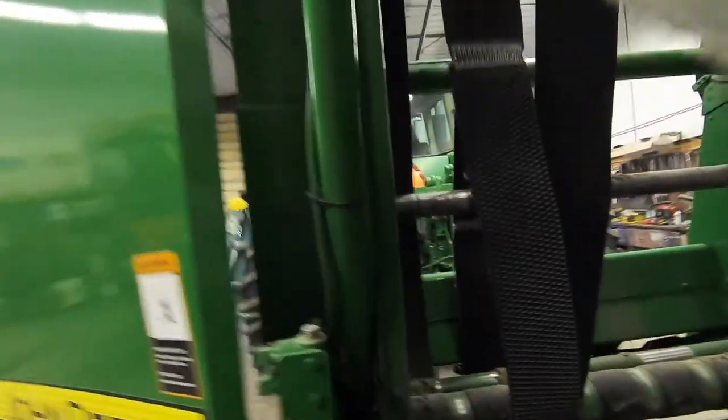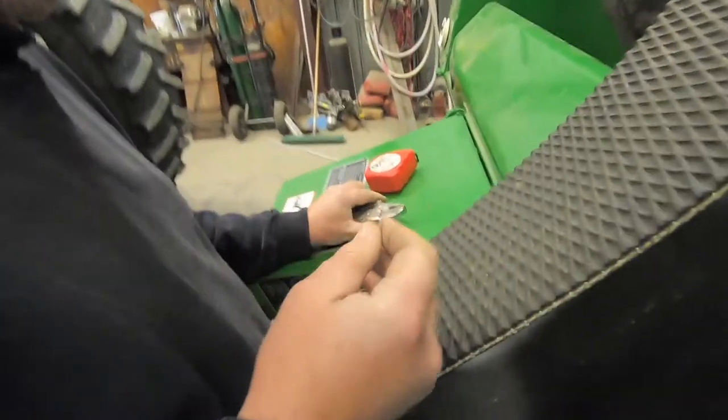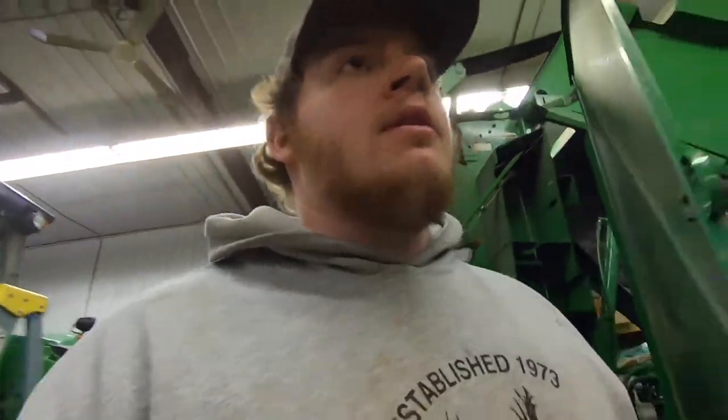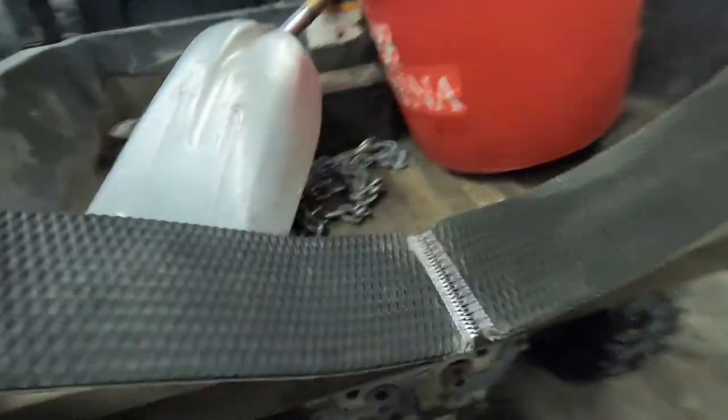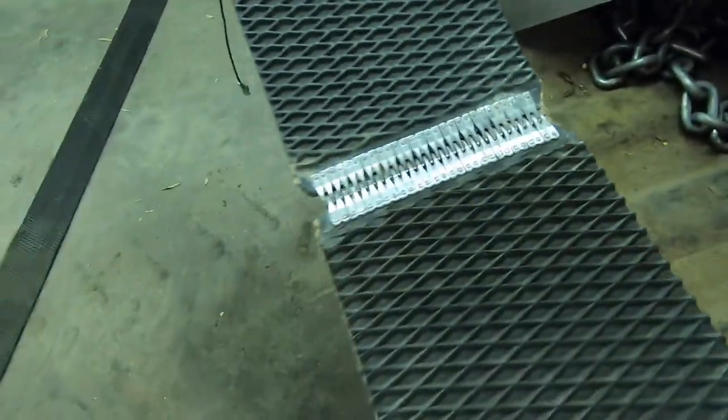There's one long here, one over there, and then this one's a short. This one we're going to have to cut because it's all jacked up where the splices are all bent — there are actually two pieces in there that are overlapping and we can't hammer a new pin in to get them out. So hopefully with a little luck we can get this last one out. The second-to-last long is out of the baler, but this last long has a double splice in it and we can't get it out, so we'll have to figure that out.